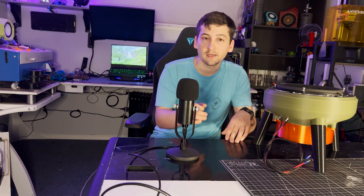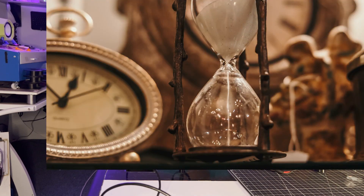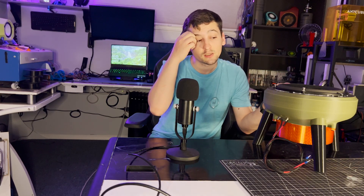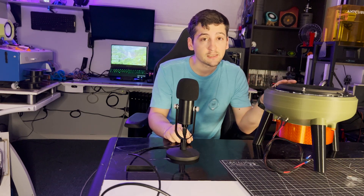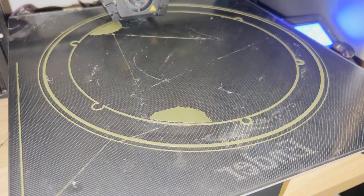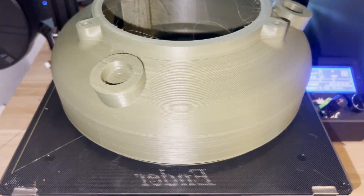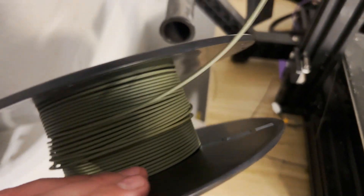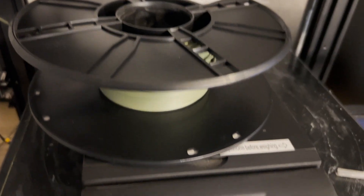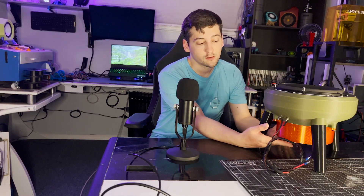For the box, I wanted to do a wood box, but time and money constraints put me in a position where I just had to do a 3D printed box to get testing done in a timely manner. I pretty much maxed out my 300 by 300 build plate building this box, and used almost an entire kilogram roll of PLA printing this top portion. There's about 50-60 grams of filament left on the roll, and the bottom piece and legs are PETG.